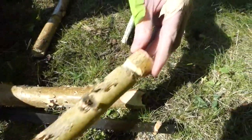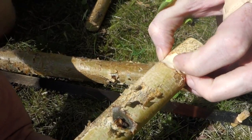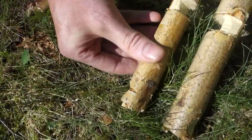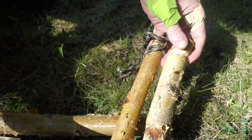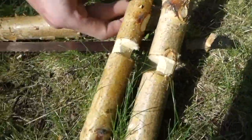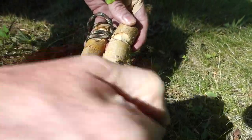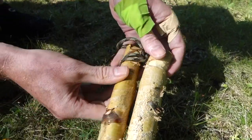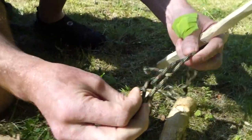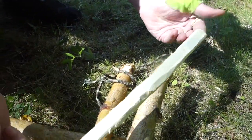At the top I also made some notches to accommodate the rope so it won't slip out. These two pieces are basically mirror images of each other — you have to make sure everything is at a 90-degree angle, so the saw blade faces this way and the notches are in the same direction, with the rope notches on the other side. For the rope I just used a bit of paracord, and you need a stick to tension the saw — just a basic stick.